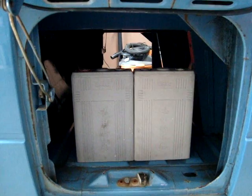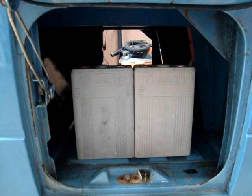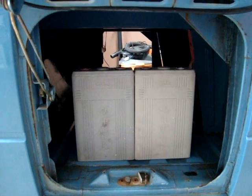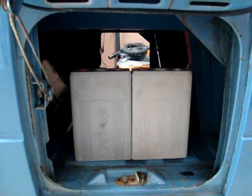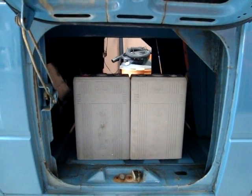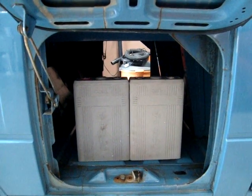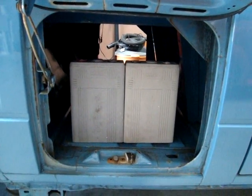And we'll put the slightly larger side on the passenger side here. It's only a 25-pound difference, but you always have a driver, you won't always have a passenger, and that'll put a little bit extra weight on the passenger side, keep things balanced. And the distance between the two racks, you'll see, is very little. So let's take a look at what we came up with.